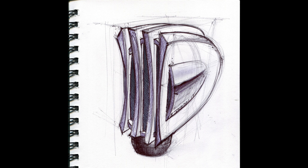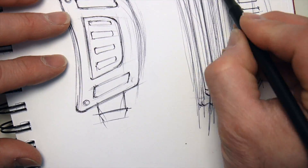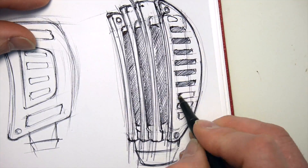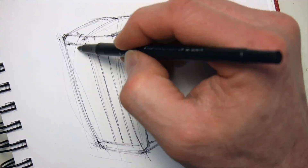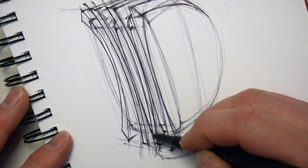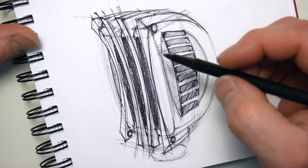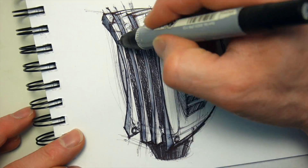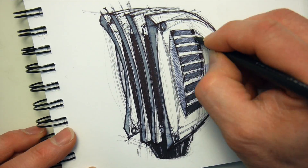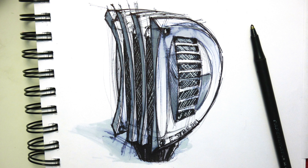This was the very first sketch that I did, and this all came about because I was trying to create a microphone that I could use for my YouTube recordings. I didn't really know much about microphones, and I thought maybe I could do a DIY ribbon microphone and build my own. You can see in this sketch at the top and the bottom there are little holes — that's where a mechanical fastener would bolt the three parts together: a right side, a left side, and a centerpiece to sandwich all the internal components.